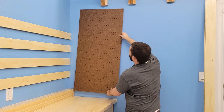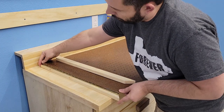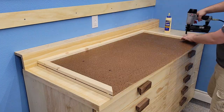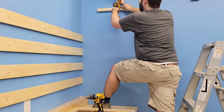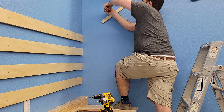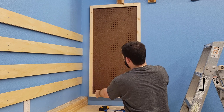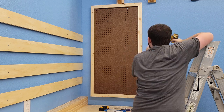Now for this corner, this is where I'm going to put the big pegboard. To dress it up and ease the installation, I put a border around it out of some 1x2 material. I mitered all the edges, then glued on a front and back piece and nailed through both. After repeating that all the way around the board, I broke the edges with a block plane and had it ready to mount. The back frame keeps the pegboard off the wall so the peg holders can slip easily in and out, and it also allows for easy mounting using a piece of scrap 1x2. I hung the scrap piece with one screw in a stud and another in a wall anchor, then put the frame on top. Two small screws through the holes in the pegboard into the mounting piece keep the whole thing from falling off the wall.